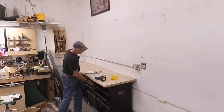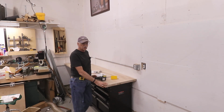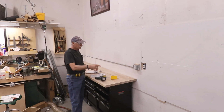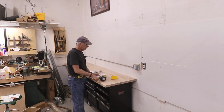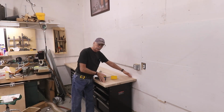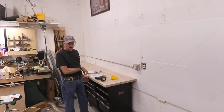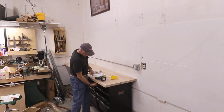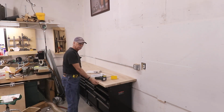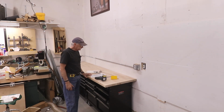Nice. Now, this is going to change a little bit. I'm going to take a couple inches off of this and a couple inches off this way, because it turns out that this isn't 96 inches, it's 98 inches, and I want it to be 96 inches. I also want to shorten this up a little bit. Again, shop space, and we don't need the huge depth here, 25 inches. It doesn't come in any narrow widths. And I'll move the cabinets out so they're kind of towards the edge. We'll have a 2 to 3 inch lip on here where we can clamp whatever work we're clamping on here.